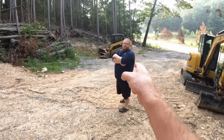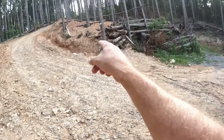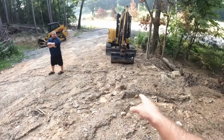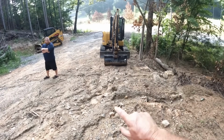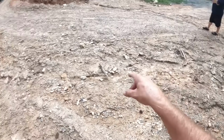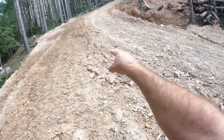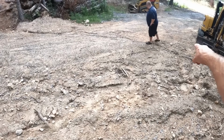And Tim is on the hunt for some culverts. We're going to put a 40-foot culvert in from where that water's going there. We're going to run it across the road and over this area, and then I'll make a swale where the water will run out. And later he'll riprap that in and riprap that in up there. Our main problem is the water line, that rough area coming in through there. That's the water line coming through there, and it goes right through there.